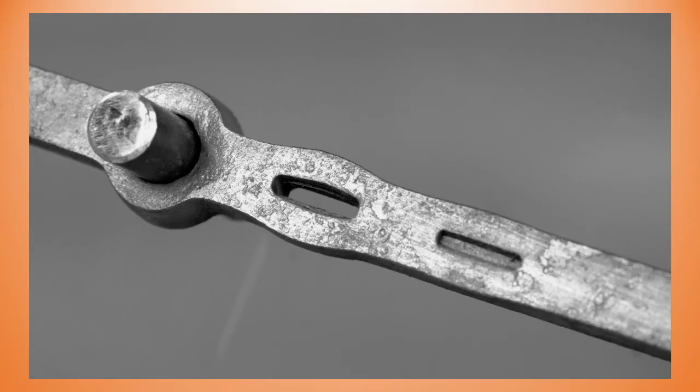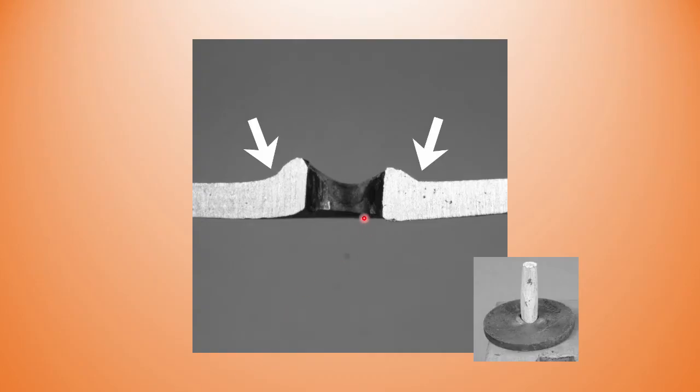Using a slot punch, we can control the character of the thickness of the iron material. It does have some limitations: if you slot punch into a wide plate, as you drift you're going to push the material away until it meets the resistance of the plate, forge a dam, then dress the dam and go back to the slot punch — back and forth. So a wide plate would be a good application for the round or square blacksmith's punch instead.